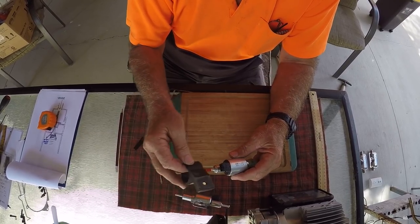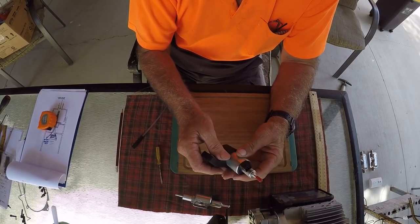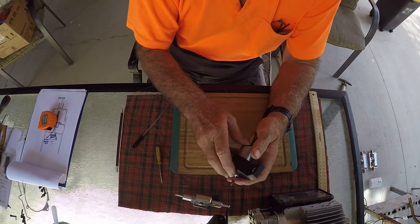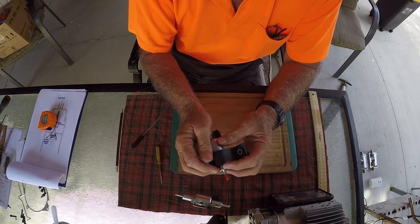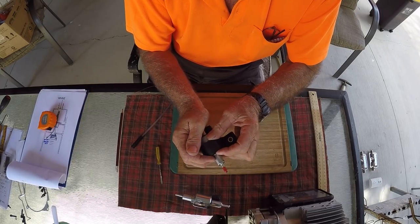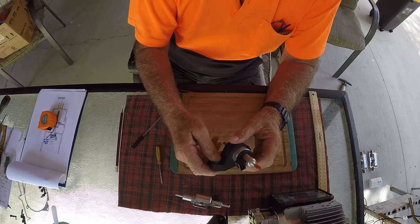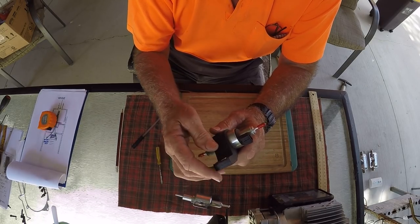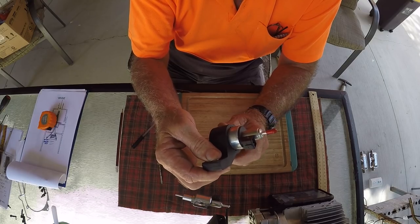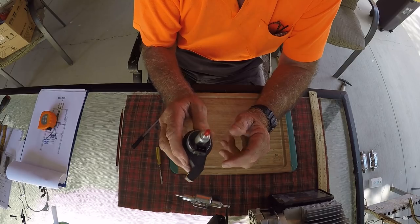Now, because of that particular sound, what you need to do is isolate the pump, and they'll come with these rubber mounting brackets. And this then is mounted to the hull of your boat or the side of the caravan or motorhome, and it tends to isolate out that ticking noise. It's very important that you don't hard mount these units.